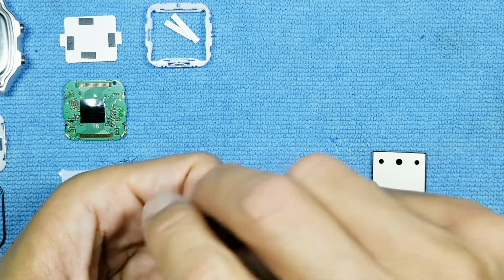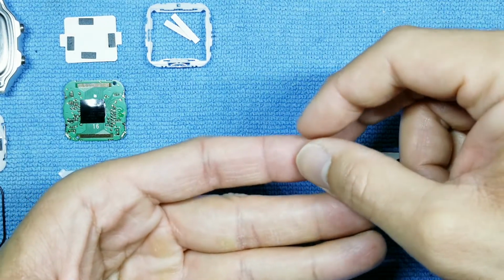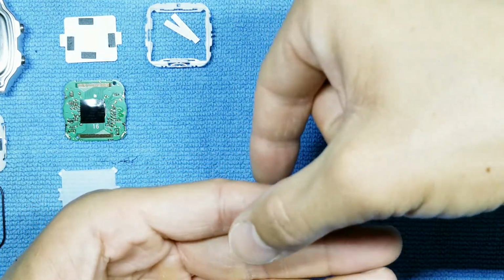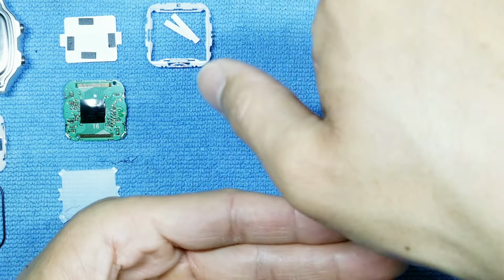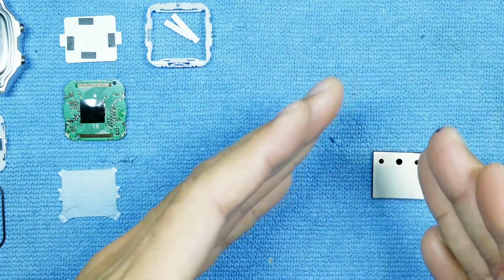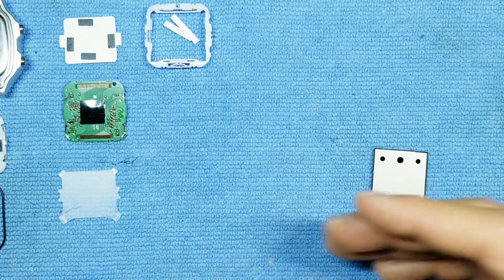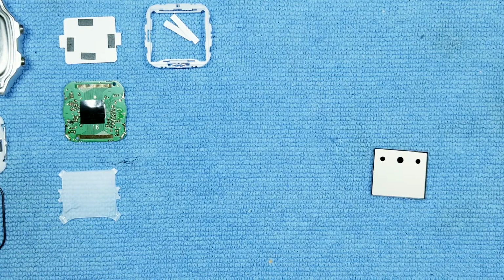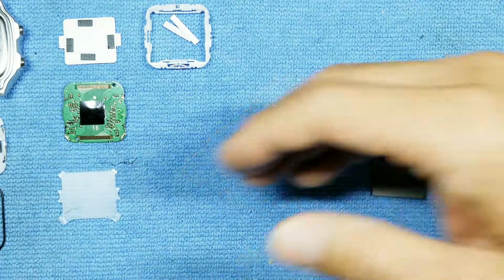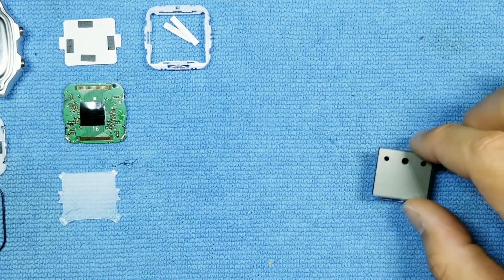Then we're going to take a brand new polarized film and put it back over, but we're going to orient it 90 degrees to the right. So rather than put it down exactly how we found it, we're going to put it down, turn it 90 degrees, and then stick it onto this middle portion. By turning it 90 degrees, you're going to change the background from this typical white background to a black background, and the numerals that were usually black before now become that whitish yellow. Hence, by turning the film 90 degrees, you're creating that negative display. So hopefully that makes sense for you.